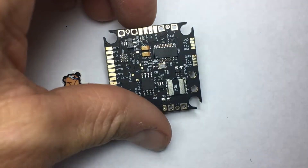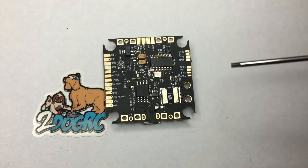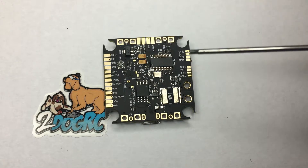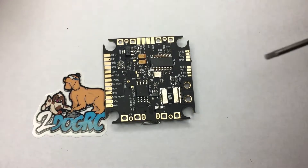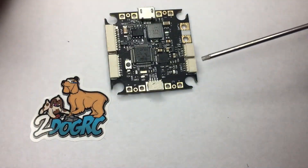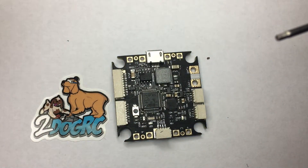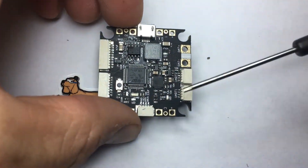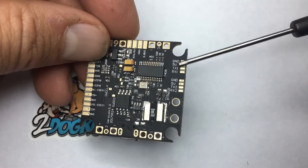So this is the back side of the board — I'll tell you why I'm starting there in a second. Basically we've got a 4-ounce copper, 6-layer PCB. It's got ESC and battery leads with gold plated tabs. What's really nice is you've got these gold plated tabs on the back and then the JST in the front. Diatone wanted JSTs so you could plug into an ARF, but we made sure that if these broke off, you're not stranded — you can fix that.